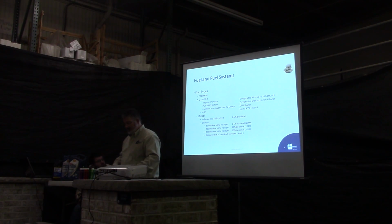Fuel systems. Oh, I'm sorry, any questions on the air intake system? Go ahead. Do you have any recommended brands that you prefer to buy? No. It varies. Sometimes you're better off going OEM. We sometimes will deal with Donaldson. We try to buy a quality filter. In some of our filtering applications, we've tried going with Baldwin, and we've just never been impressed with their quality. We've learned to stay away from Baldwin. We try to stay with Donaldson or an OEM filter.